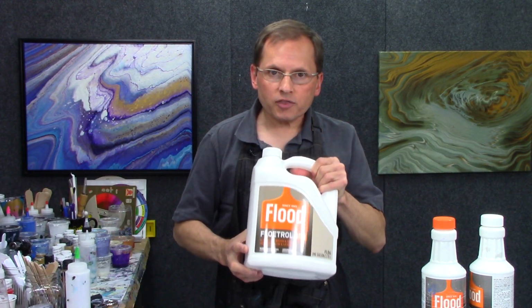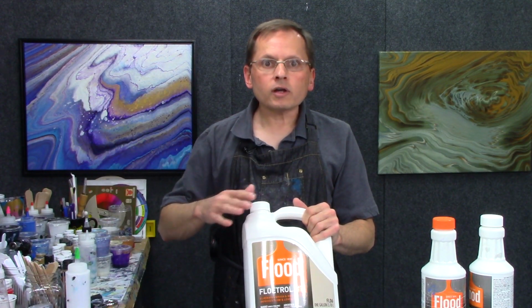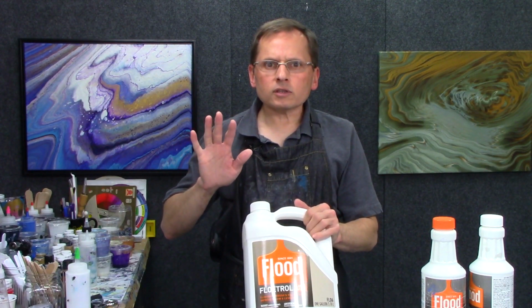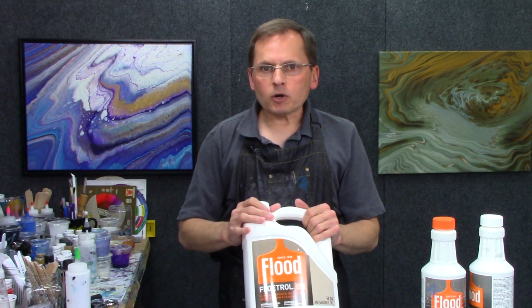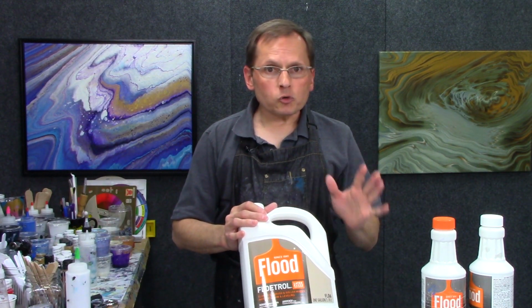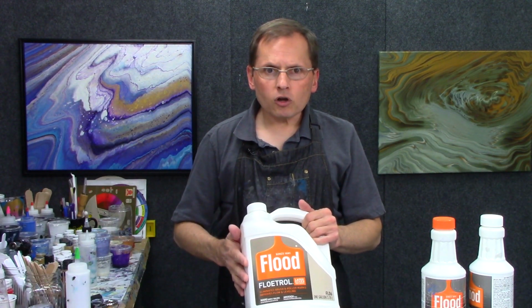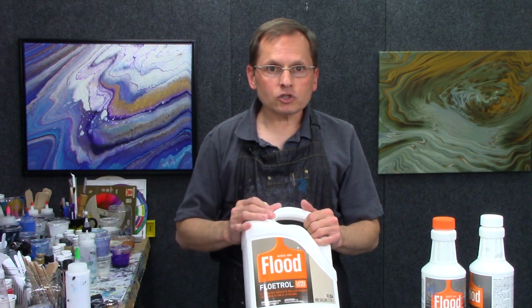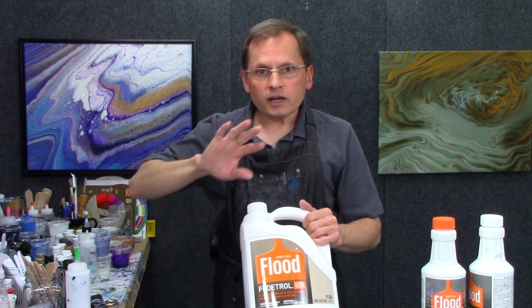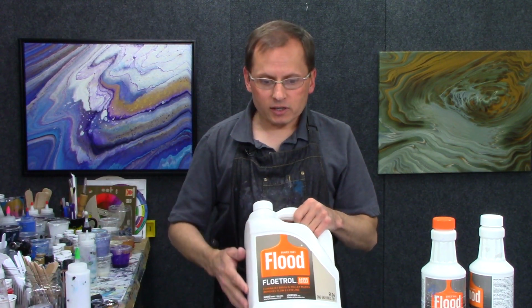And what it does is it thins the paint down, and so you're able to roll it or brush it on the walls better, and it will eliminate brush strokes. It also slows the drying time down a little bit. Acrylic paints or latex-based paints that you put on your wall tend to dry pretty quick, and they're a little thick when they're right out of the can. So the Floetrol is great for thinning that down just a little bit, and the roller marks, brush marks kind of just blend together, which is fantastic. I've used it a lot for that, actually.